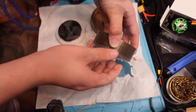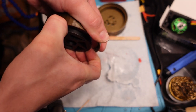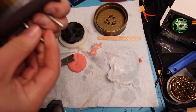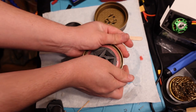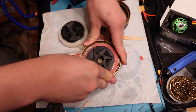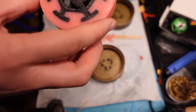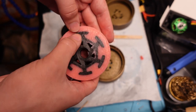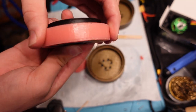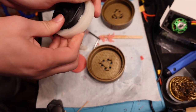This one's really stuck to the mold. I'll try my other idea, which was to press it out with some dowel pins — I think these are actually just pieces of 4mm shafting that I cut. I can hear it kind of giving... there it is. Oh, this one's even cleaner — didn't even get any buildup really on the bottom. Still feels greasy but I think it's the Vaseline. This is very pink, unfortunately not very red, but it came out well. Feels just as firm, maybe slightly softer — maybe the dye interfered a little bit — but I'm trying pretty hard to peel it off and it's not going anywhere. So I guess I designed my hubs well.